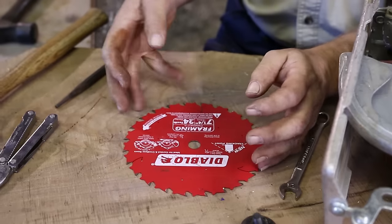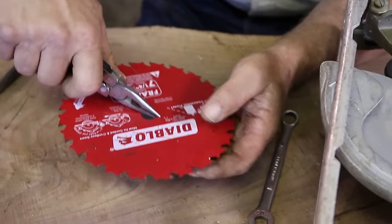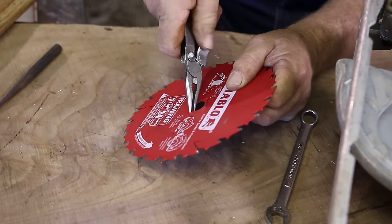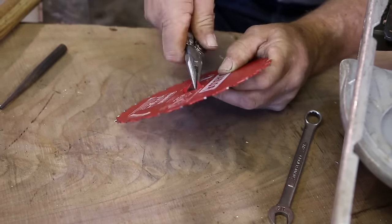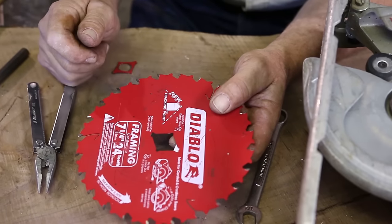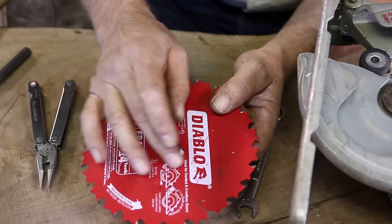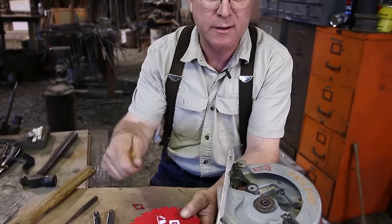You better be careful — you don't want to bend that blade. Here's one reason to carry a Leatherman: you can get a hold of that thing, give it a little twist, and you see it start to open up. But as soon as you start beating around on there, you have the chance of distorting that material in the eye of your saw. That doesn't help a thing, so I like to twist them out with a wrench.